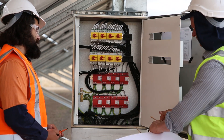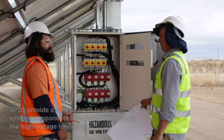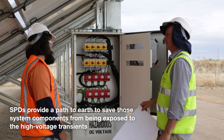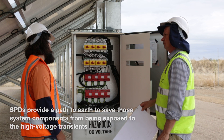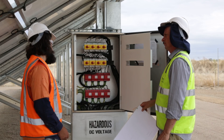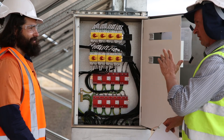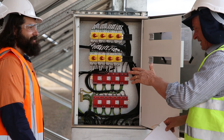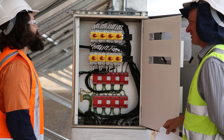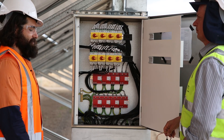What is an SPD? An SPD is a surge protection device. It monitors — if a lightning strike hit the array and sent a current back through the cable, it would automatically divert into the SPD. But this is not specific lightning protection — it's surge protection. They're sort of related. Lightning is probably the best example of how to explain it, but a short circuit could also cause excess current as well.